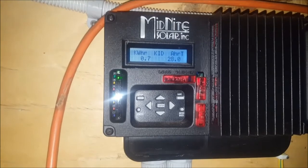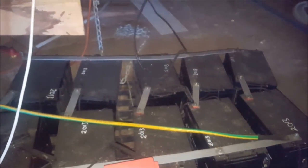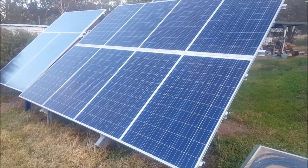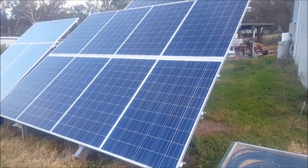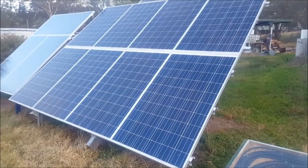That's what it's taken to replace the electricity that the inverter, the fridge, and a few small vampire loads such as plug packs have used overnight and during the day today. That's my 24 volt, 375 amp hour battery bank. The two kilowatt array has only put 28 amp hours into it. Some of that also involves overcoming resistance of the batteries — they always take more than what they give out.